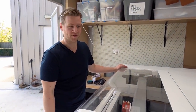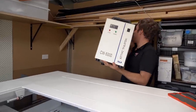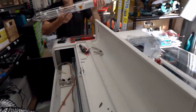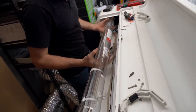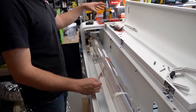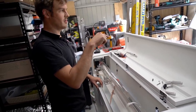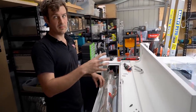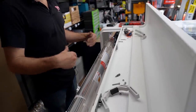It's the most serious piece of machinery I've ever looked at, let alone leaned into. It's not overkill, is it? Definitely not. So can you very roughly explain how it actually works? You've got normal 240 volt power and it comes into a power supply, and then you've got the positive and the negative, and it goes through the gases and it creates a laser infrared charge and then it shoots out and goes through the mirrors and then through the focal lens.